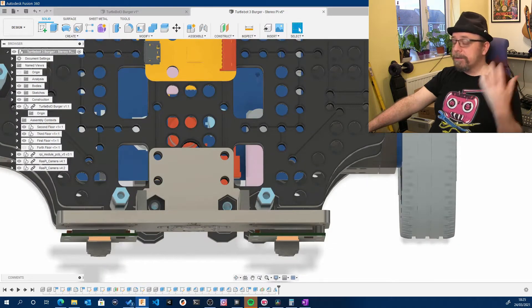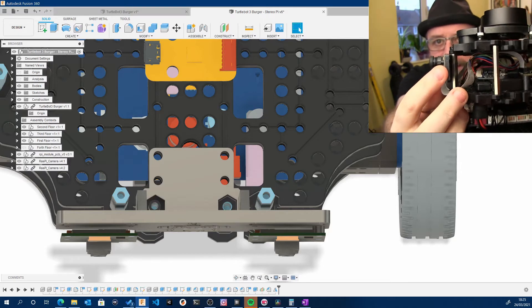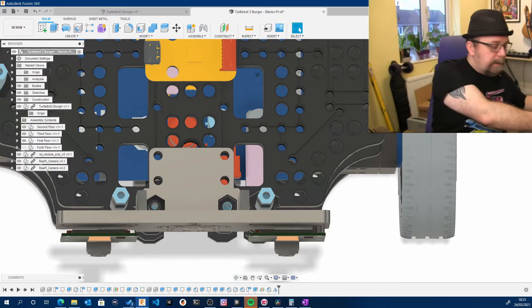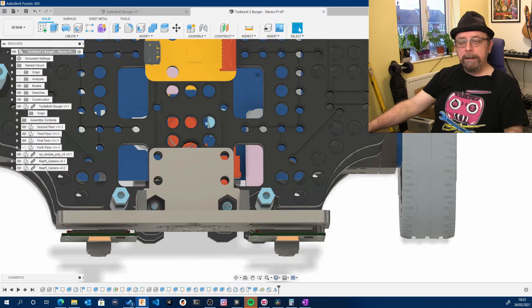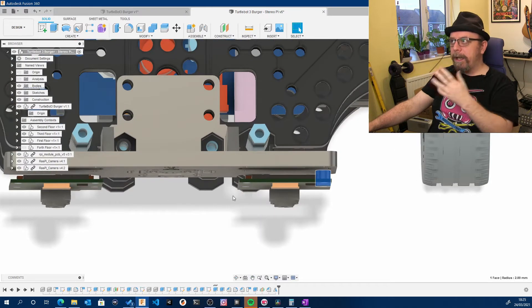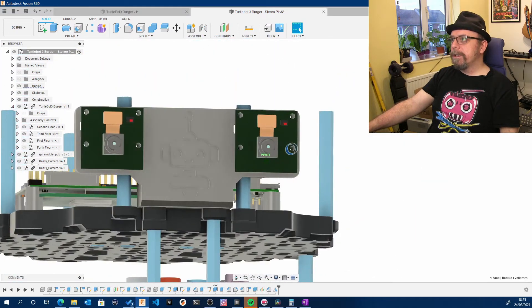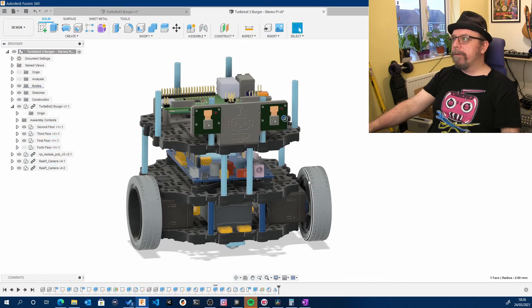One thing I'll note if you're using these files — which are available, link in the description — is that the camera modules I'm using are the WaveShare camera modules, and they sit flush against the mounts because all components are front-mounted on a one-sided board. The standard Raspberry Pi camera modules have a socket and a few other components on the back, so there are little standoffs — I think three or four millimetres — included on the Thingiverse page if you're using a different type of camera. And obviously I put my cute little logo on the front, just because I can.